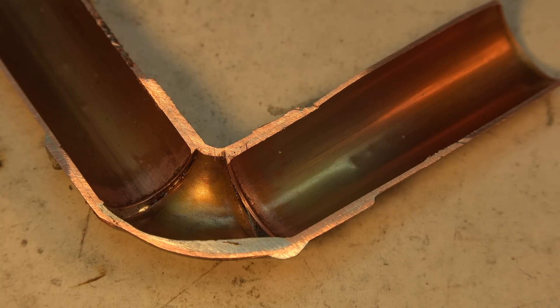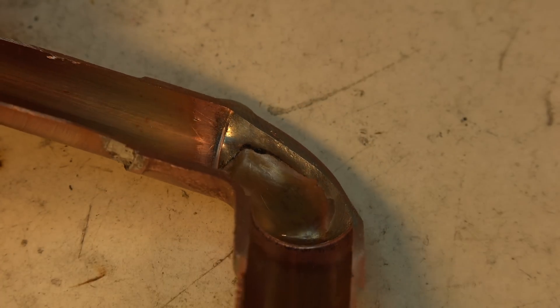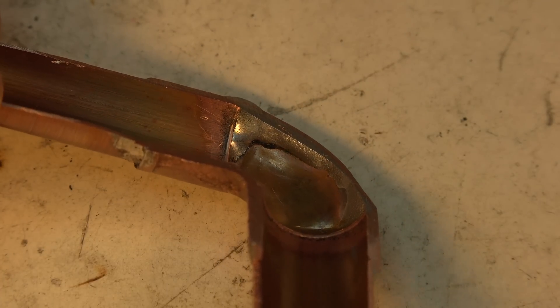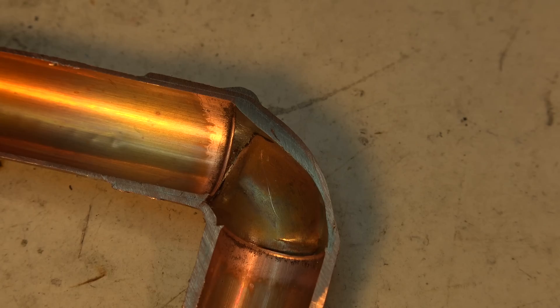It's actually reduced the cross-sectional area in this fitting — that's why we don't put all that solder in there. It's not useful, it won't seal any better, but you will get excessive amounts of solder and it'll start filling up the pipe. I have seen so much worse that literally filled the entire pipe up with solder. Anyway, that's the reason we don't use a lot of solder — capillary action is going to pull enough in there, it just sucks it right in, and it's done.